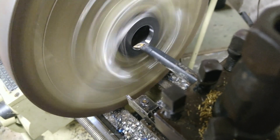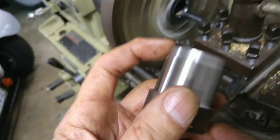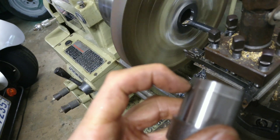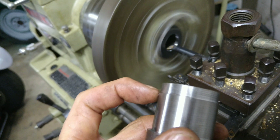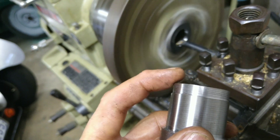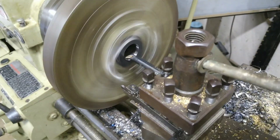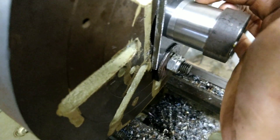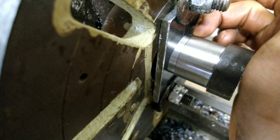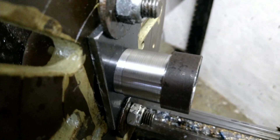Here I'm boring it out. This is going to take this part here which I made earlier. Notice there's a shoulder on there so that will fit into there snugly. Then I'll put a chamfer on here and that is where I will weld it up. This is a nice snug fit — it will be banged in up to that face and then I can weld on the other side.